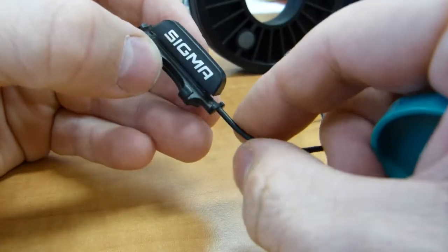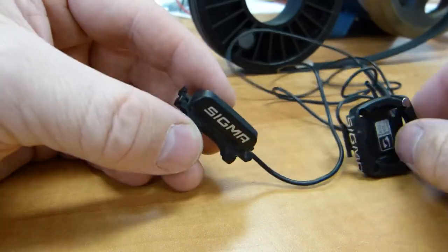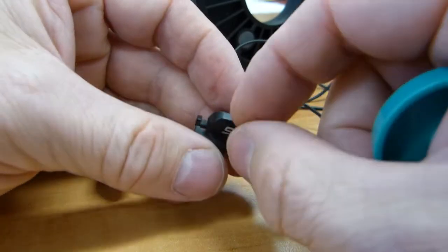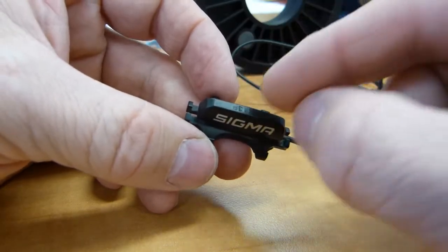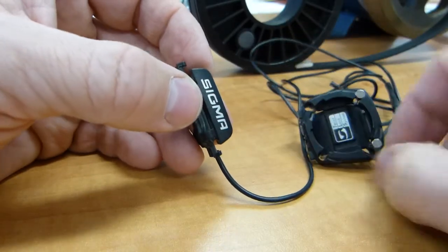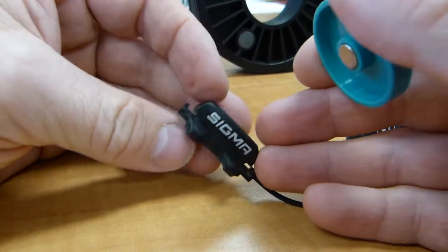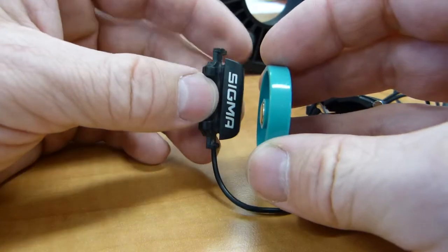This signal is a very weak voltage that travels in the wires up to the cradle. The strength of the magnetic field that moves in the proximity of this sensor wire generates this voltage by moving some of the electrons — ripping away some of the electrons of the exotic metal coiled up inside — so that those electrons actually travel up the wire into the cradle to those pickup points. For this to happen, the coil needs to be of good quality, the magnet needs to be strong enough, and the distance and alignment between the two of them is critical.